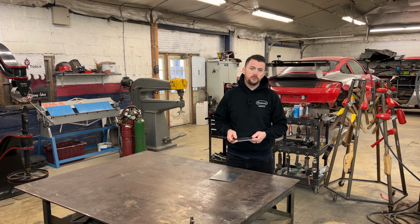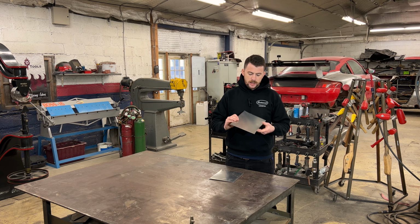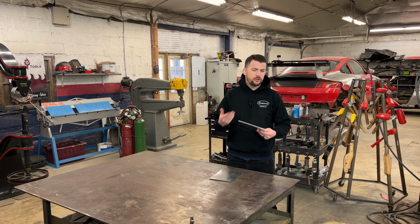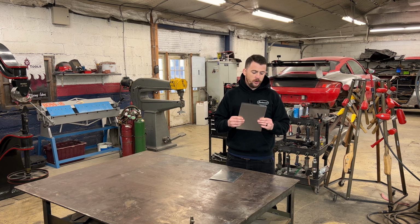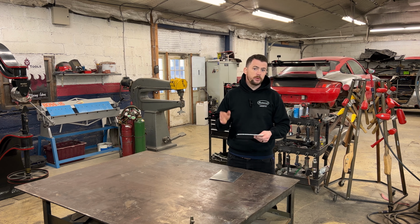Annealing is the process in which you heat up the metal and then let it naturally cool so it kind of restructures itself and removes any stresses and makes it less brittle. This is important with aluminum because as you work it, it'll become hardened. And in this case, if you start with an already kind of hard material, it'll bring it back to zero hardness, hopefully, if you can do it right.